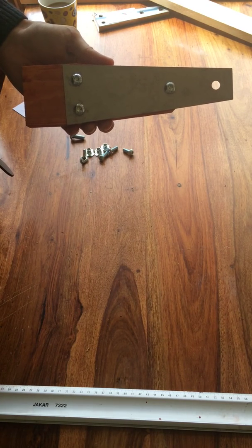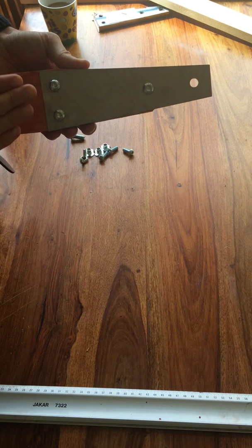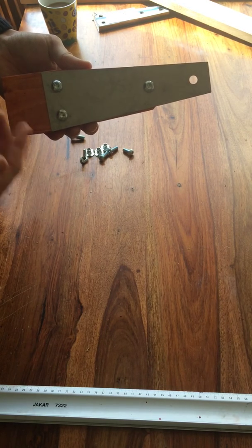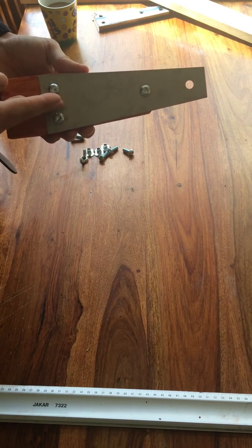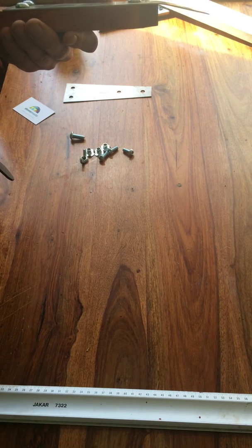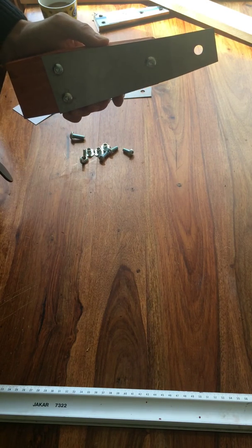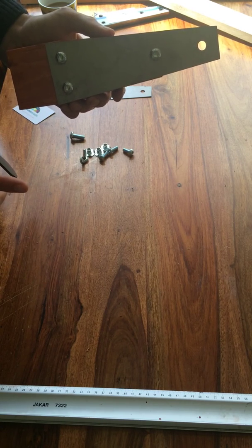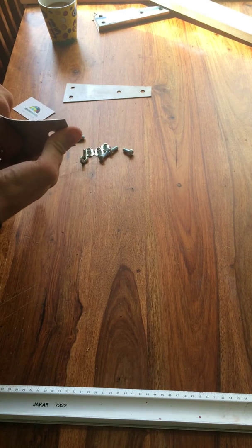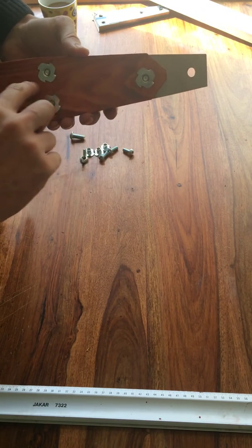Once you have done that with all your struts, you need to make a decision on which way you bend the bracket. Some Dormade structures are best built with the bracket on the outside, such as hen houses, where it doesn't matter that the metal work is on the outside. In that case, you will just bend the bracket slightly back by about 12 degrees, and that will give you the dome shape — the bracket will flex to form a true geodesic dome structure. If you are going to clad the dome, perhaps in polycarbonate or plywood, then you want the metal work on the inside. You would just bend in the opposite direction, and that would allow you to affix your material the full length of the wooden strut.